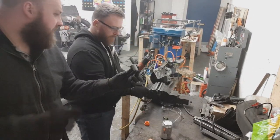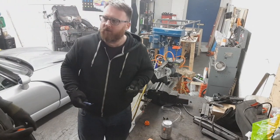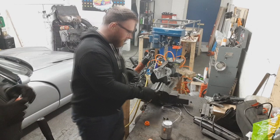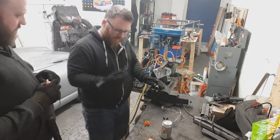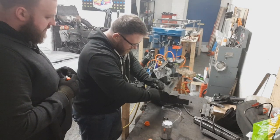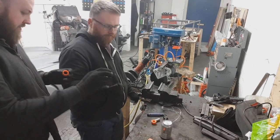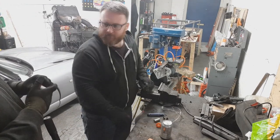See inside here — this has happened halfway through that. That's called an internal burr. This is a deburring tool — you can just peel it like an apple. That's better. No hammer needed — that went on easily. It's amazing the difference that makes.